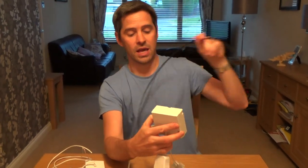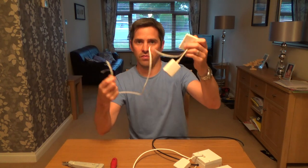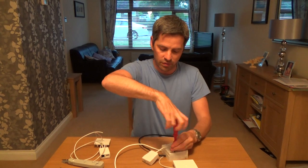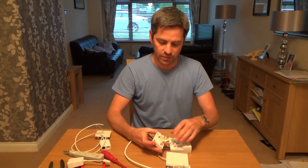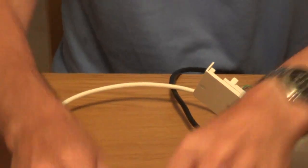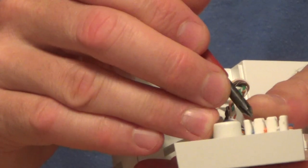So pretend this black cable is the main cable from outside feeding the master socket, and you've got two cables already and want to run a third extension from the office into the master socket. You need to undo the front plate off the master socket, gently slide that out, and as you can see in there we are full — we've already got two wires in each of the IDC slots, so we can't punch the third wire in.